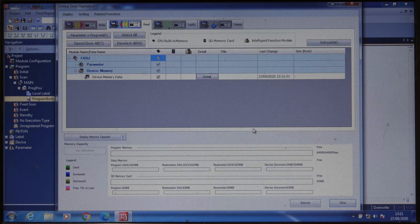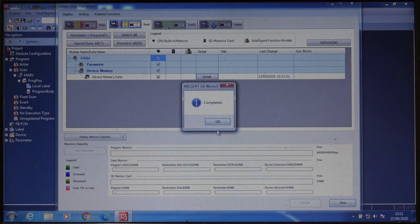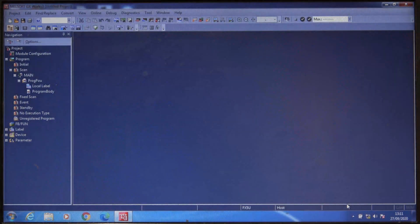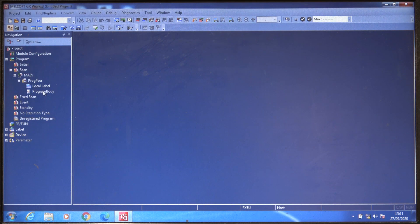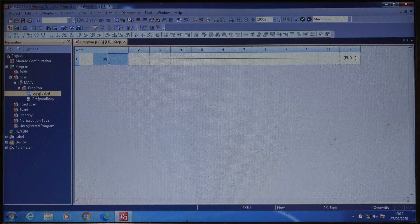Since I already established communication, I can just read from the PLC. As you can see my PLC is empty, so I read what it's got in there — execute, yes to all. That's pretty much what's inside the PLC. You go to the program body, click on Main, and that's where you are for basic uploading and downloading of programs. We're not going to get deep into programming — I'm more on the service engineering side, so I focus on uploading, downloading, and making small changes.